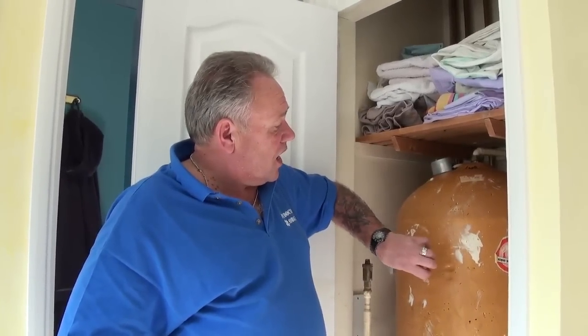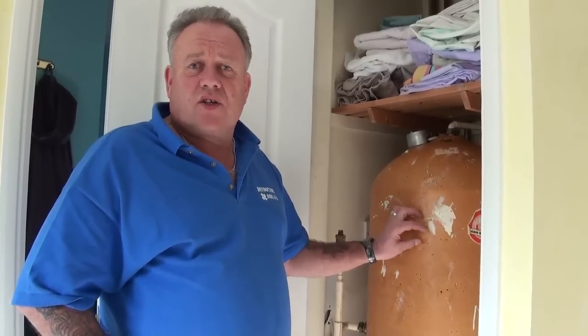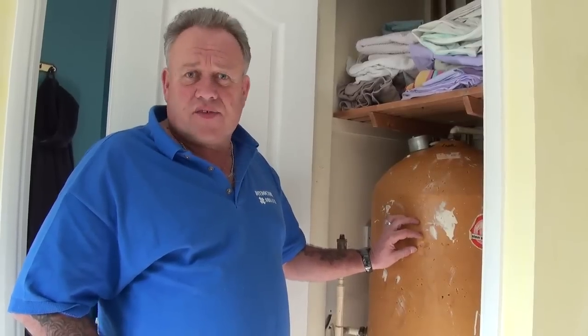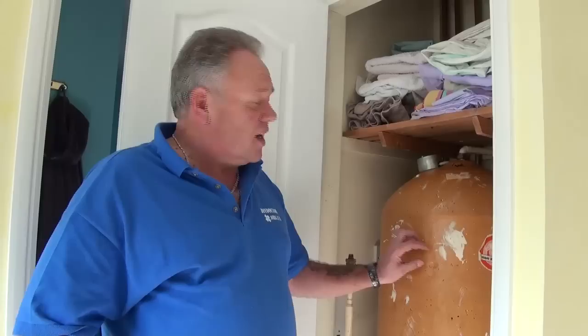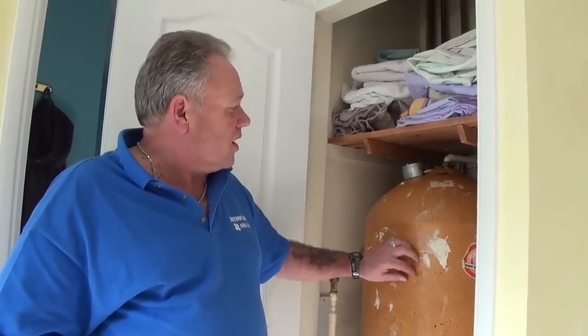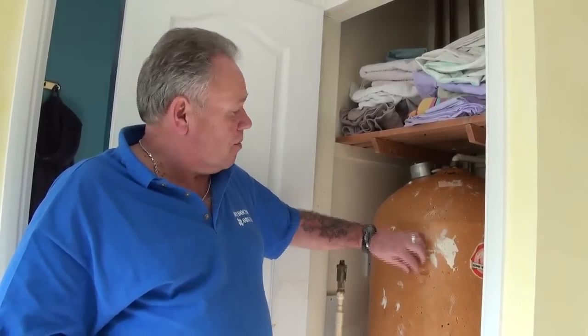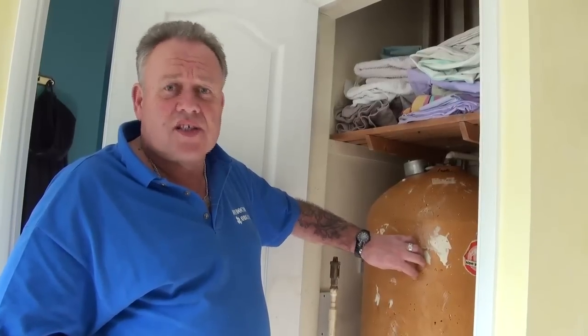The other reason for using an Essex flange is that it allows the hot water to the power shower to be the first water taken from the tank — it has priority over anything else called for. So if you turn your bath tap on at the same time as running the power shower, the Essex flange ensures the power shower has priority. The pump must not be allowed to run dry, and the Essex flange is a priority valve that feeds the pump before anything else.